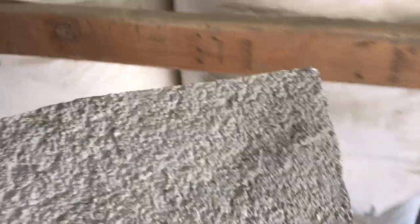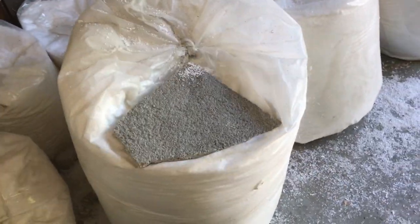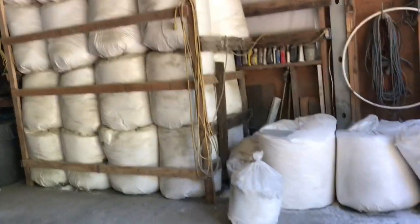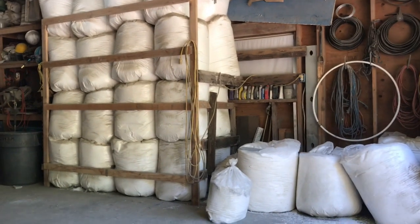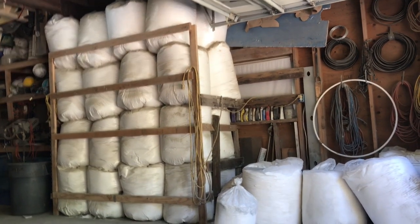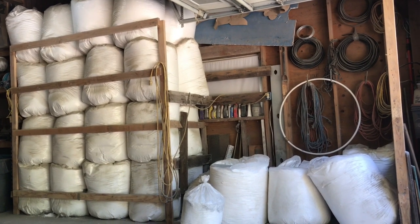When you put it up against the dirt, it's tough — you can stand on it, tie your rebar, get the grid in there, and work up against it. It's like hard cement, even though it's made with a styrene aggregate. It's a very formidable material yet very insulative. You can use polystyrene regrind — it's a waste product you can get for next to nothing — or you can use perlite or vermiculite. Both perlite and vermiculite are naturally mined lightweight aggregates that are also insulative. Polystyrene regrind was just easier and less expensive in my area.